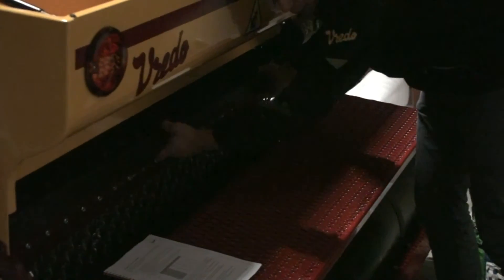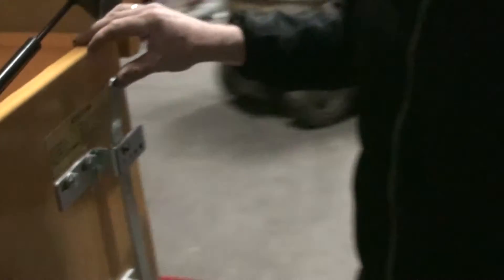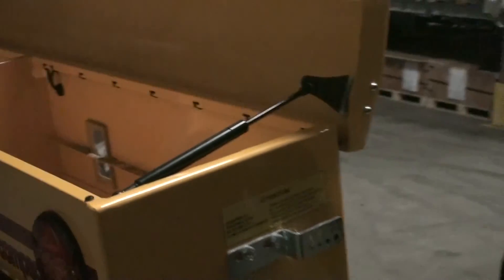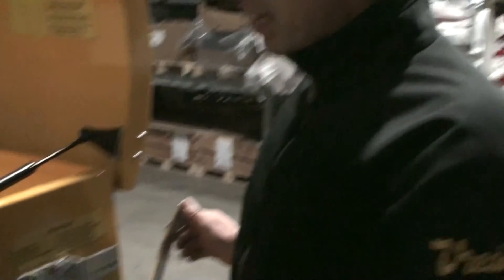The part still left over in the seed hopper can be taken out with the calibration tray and the bottom flap. Put the calibration tray in calibration position and open the bottom flap on this side. Open it fully and you will see that the seed streams into the calibration tray. Take it away by hand and in that way you can finish the seeding easily and store the expensive seed back into your seed bag.